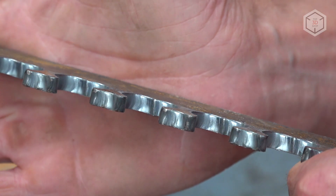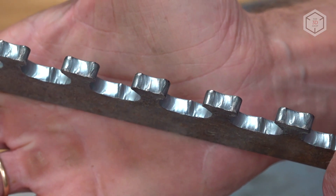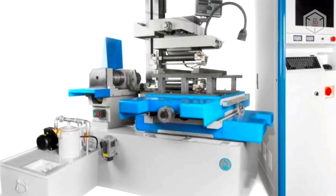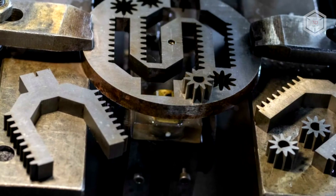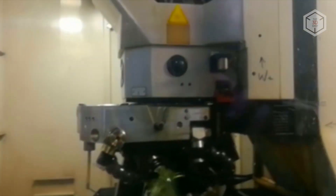Plasma cutting has its own nuances — such machines can burn sharp corners and cannot handle high detail. One of the most high-end modern technologies is electrical discharge machining, or EDM. Such machines can produce remarkable detail and the highest cut quality. As for the drawbacks, EDM equipment is exorbitant in dimensions and cost, and these machines can only cut electrically conductive materials.